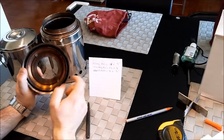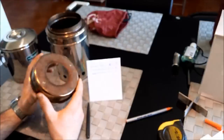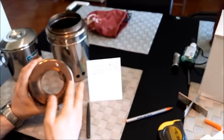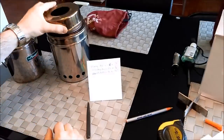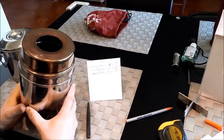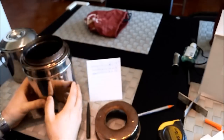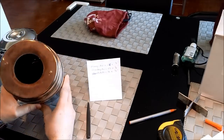So let's talk about how I secured the inner pot top to the outside concentrator cap. I just drilled some small holes in there, got in some stainless steel screws, and used a Dremel tool to cut that and sand it nice and smooth. And there you have it — nice and secure. It sits on there really nicely, doesn't fall off, won't move around when you're putting a pot on there. As you probably saw from my first couple of videos, this thing was sliding around. Although it won't fall off because you do have this part preventing it, it certainly will move around a little bit and that gets annoying. So it's in your best interest to do that. Really nice and sleek, solid looking — not hard to do.